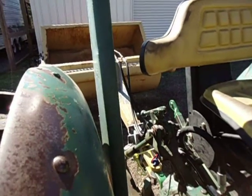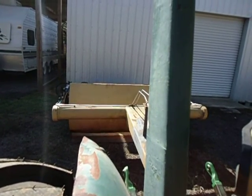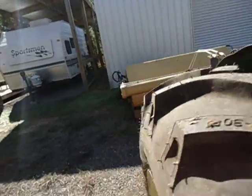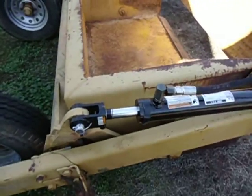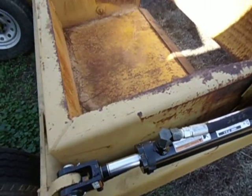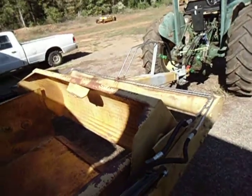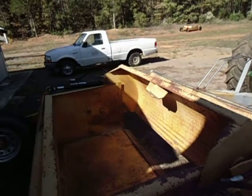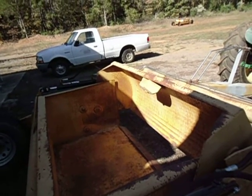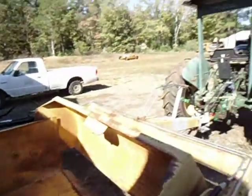Back to raise, now we're going to go forward to dig. It pulls in for dig mode — I still got travel, so I can go deeper than I thought. The rise on that hitch is only a little over two inches, and so my dig depth — I can probably go up to four to five inches on this thing at full extension, which is a lot. I won't ever go that deep, but you can regulate that with your hydraulic.